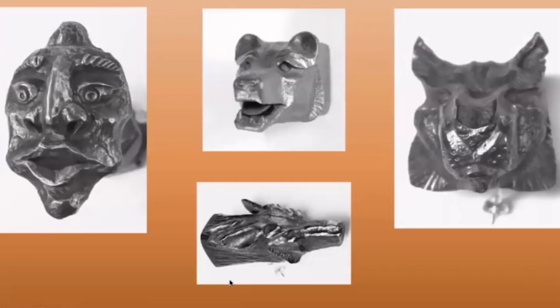These are a series of heads. The lynx here and the wolf are very much Darryl Nelson's. He does these, and they use very much the same tooling. You notice he doesn't cut for the jaw. These are both out of 1.5 inch square. These are my sort of following Darryl. The only difference with the wolf is that the ears are cut from behind after you've dropped your fuller in to give them that sort of concave shape. Then you're going to cut from behind to lift the ears.